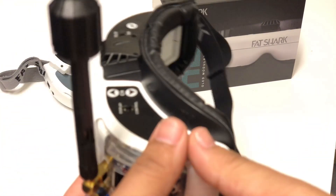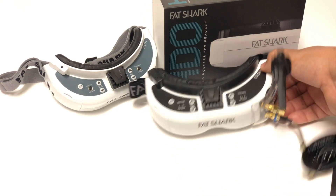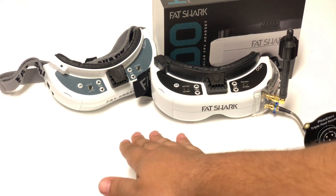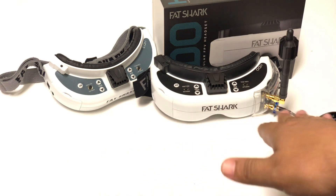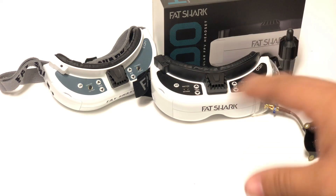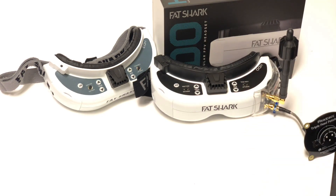To give you a description: on many of these Fat Shark HDO goggles, there is a row of bad pixels — not dead, just fuzzy — running along the very bottom portion of the screen on both sides. It looks like a horizontal line of interference, about 5 to 10 pixels tall, that just fuzzes around and stays on permanently, making it a constant distraction.